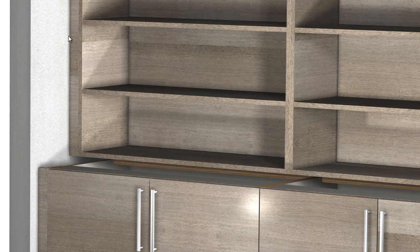Moving over here, we have a filler on this side. Basically a mirror image of what we're doing down below, except the exposed interior cabinets are 13/16 deeper. Same thing over here. We have a 15 and 13/16 deep exposed wall cabinet, and a 15 and 13/16 deep finished-in panel right here. Again, nice place for book storage. It's going to be plenty deep and plenty heavy enough. It just creates a real nice library.